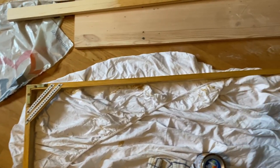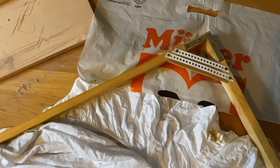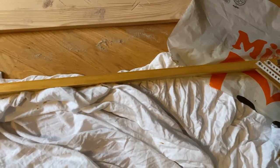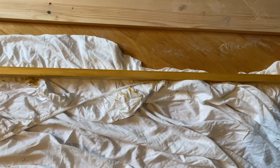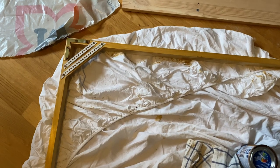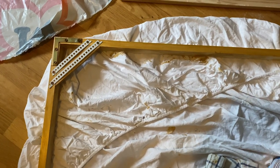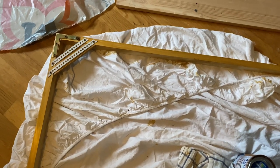You see, I have stained the back of the frame. I did about 3 thin coats I rubbed in. I'm liking the color. It is along the same color as the floor. Of course, this is the back, so it doesn't have to be perfect. When I flip it over and stain the front, I'll see if maybe I need to do 4 coats if I want it a little bit darker.